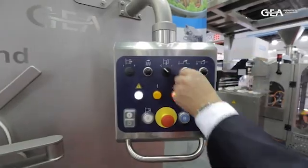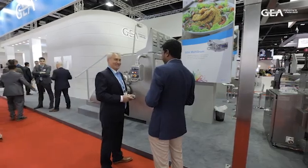What makes the Power Grind 200 unique, especially for this market and region, is that we have a relatively small footprint where we do different applications — fresh and frozen at the same time. We have a unique two-worm design with the breaker worm and the processing worm running at independent speeds. We run a low speed on the breaker worm and a high speed on the processing worm to guarantee as few fines as possible and a very clear cut after the processing worm. This is what makes it very unique for this area, because this is what our customers require.